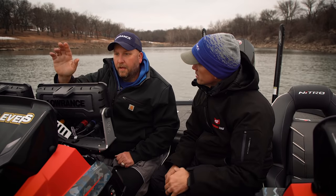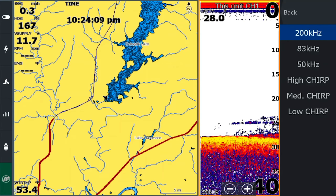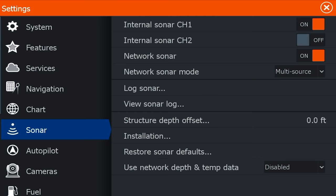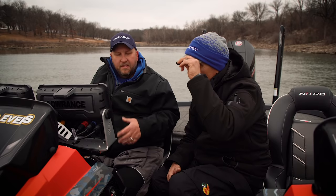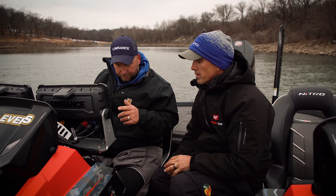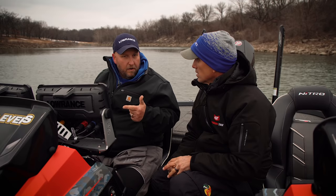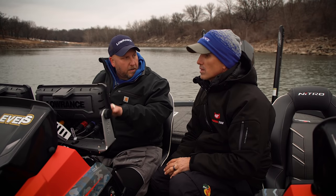The frequency — typically we're going to set that to High CHIRP. That means we need to go into Pages, Settings, and then Sonar Channel One, then Installation. So it says Source Channel One — with these units, we have two sources for sonar. You can run two different transducers simultaneously on the Live units. Channel one is the blue plug on the back of the unit — it handles 2D sonar, LiveSight sonar, and HDI transducers for 2D and down scan. Channel two works with 2D sonar but is the only port you can do StructureScan from, so your Active Imaging transducer must be plugged into channel two.